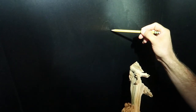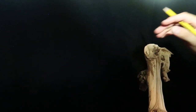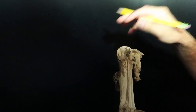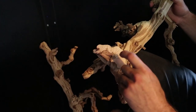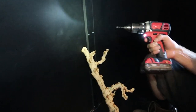I just finished using my pencil to trace around the edges of the branch so I know exactly where I'll be mounting it to the wall. I like to mark an X at the drill point. For this one I'm using one screw since it isn't a very large surface — you'll be the judge based on what you're working with. Make sure there are no holes or voids in the branch — you want a nice solid mounting surface. Then I drill from the inside out.